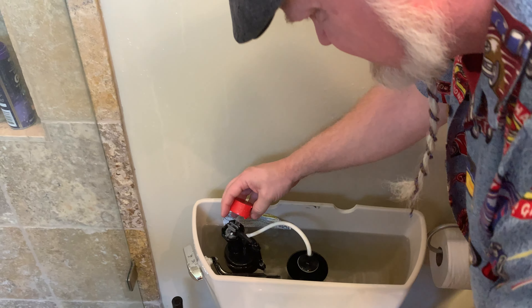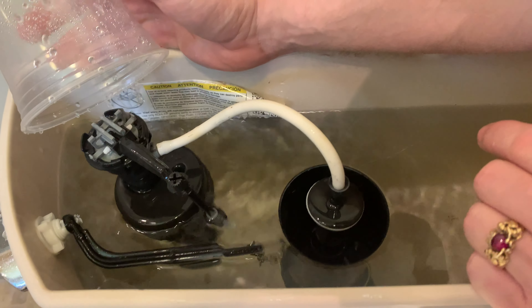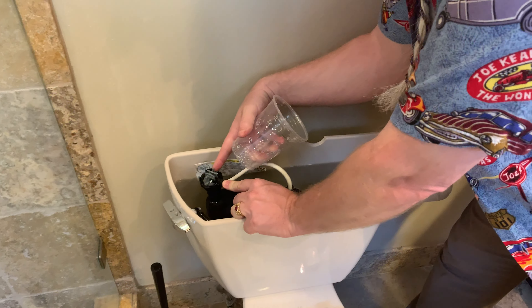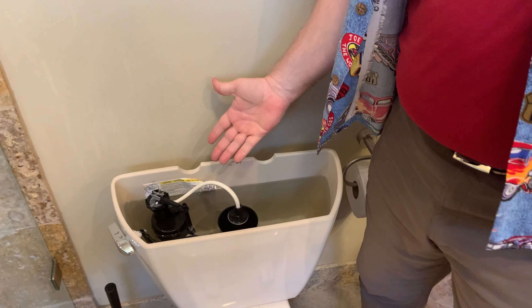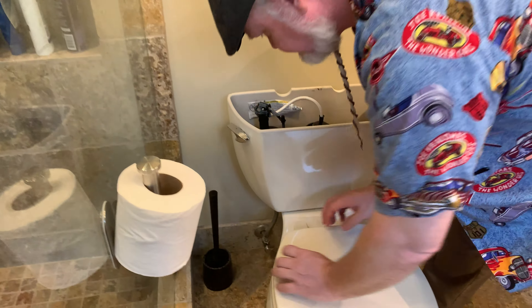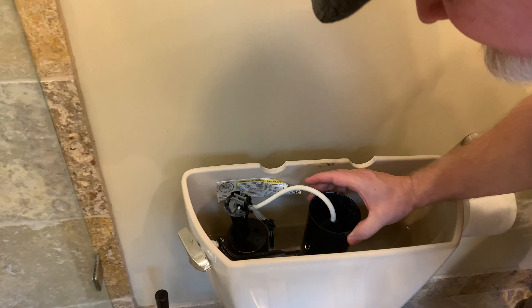Turn the floater back on. I think on ours we're gonna have to replace the whole thing because the floater was sticking down low. You can still hear it hitting the bottom of the cap — that hiss. It's normally where that hiss comes from when water's still coming up and hitting the back of that cap. It's coming right there on that little corner, and it just won't stop. The seal is not... the reason why it stops when I do that is because it's pushing it out the side. We thoroughly cleaned that — there's nothing else to clean, there's nothing else in there.